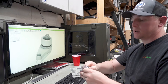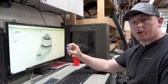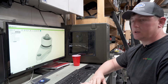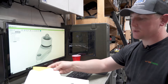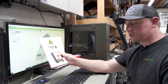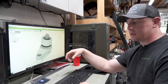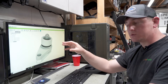The LulzBot TAZ-6 comes with an SD card that has all the software you need for the 3D printer. The problem is that SD card isn't always up to date. We found it's much better to just go to the website and download the most current version. The included instruction manuals are extremely detailed and we used them to set up connections and offsets, but the Cura software has gone through changes not covered in the manual. So make sure you go online for your software and up-to-date how-tos.